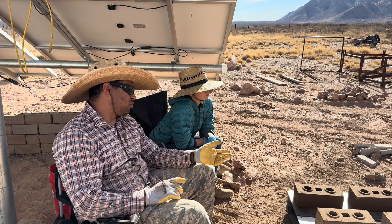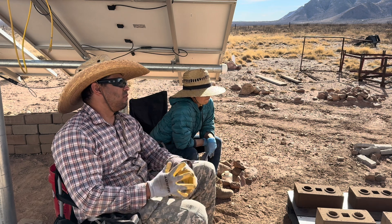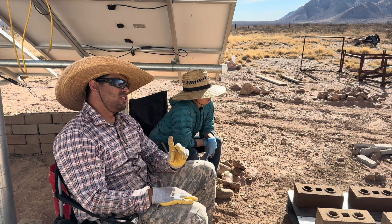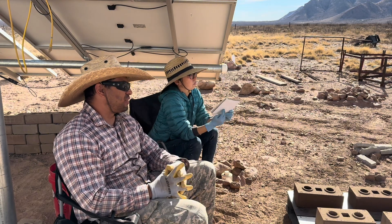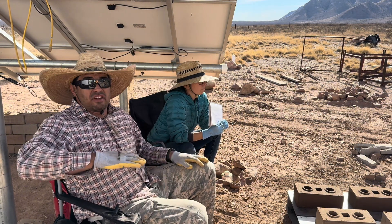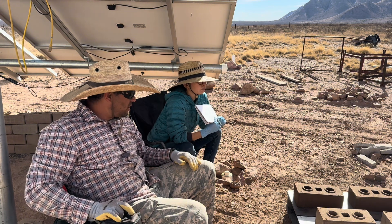We did a group at 10% with the normal amount of water — since it's compressed more, we tried it just to see, and it was okay. I was able to pick it up with a tool with no issue. Then we thought, let's go back to 15%, because we think that's probably the number we'll go with. We also went in and adjusted the plates to close easier and to make a flatter brick. Tomorrow we'll come back and double-check that those bricks are flat and line up evenly when placed next to each other.